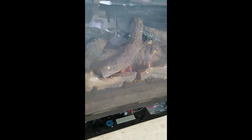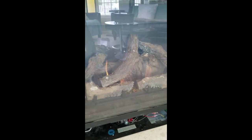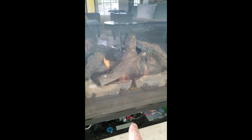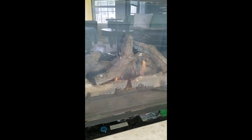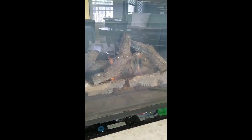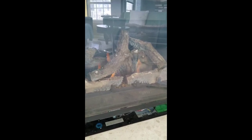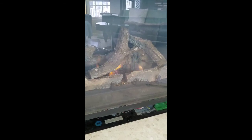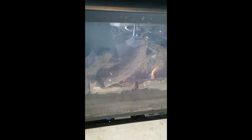And voila, she's running. Now I guess we can just test the wall switch to see that it goes on and off. What was going on with this particular stove, she had intermittent ignition, so it would ignite, go off, ignite, go off. And when we checked the valve, the turn down valve stem, something was wrong because it would keep spinning. So she's got all new parts in here now, and we'll just check the wall switch. We should be good to go. All right. Awesome. Talk to you later.